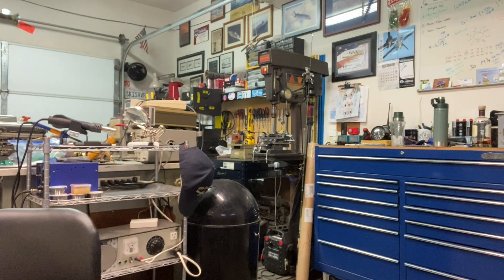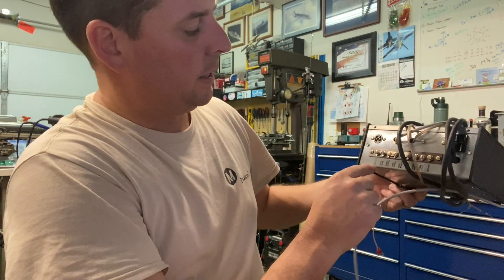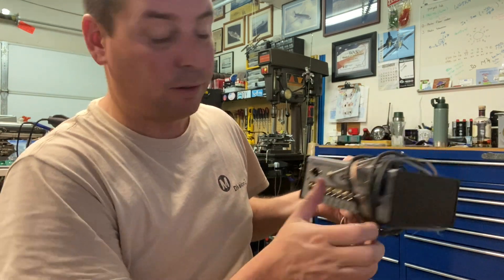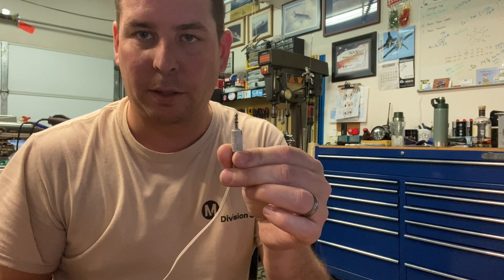As far as connecting to your terminal unit, it's pretty simple. I'm using a TU-170 — here's a second one right here. The audio input is on the back; it says receiver audio, ground and receiver audio. The way I connect is basically very simple: it's a headphone jack from your computer — it can be stereo — but you have to combine them together because otherwise you'll get low output. A couple eyelets on the end connects right to the back of that and you're ready to go.